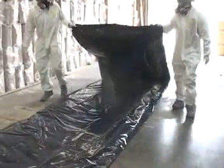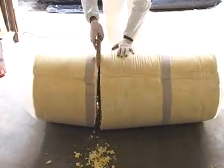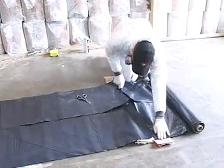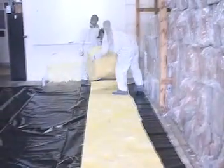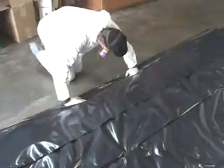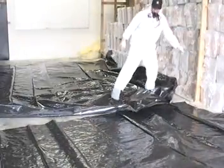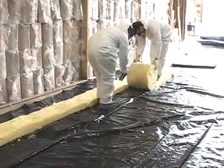One section down. Cut down a roll of insulation if you do not need the entire 4 feet and follow the same procedure: lay out the plastic and cut it, apply adhesive and roll out the insulation, cut it, add some more adhesive, and flip it. Make the tab at the top and seal the ends. Use up as much of the scrap as you can. The short ends of the insulation roll can also be used to wrap ducts.